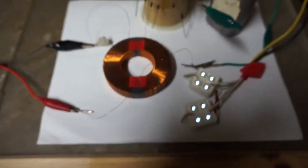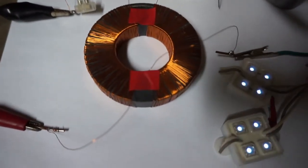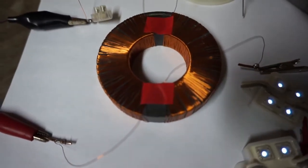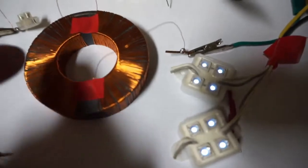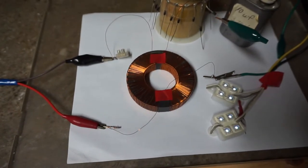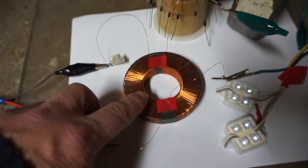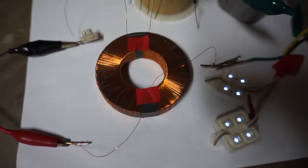What I'm thinking is that the wire — it's like 24-gauge wire on that coil — is way too thin, and it's wound directly onto the ceramic or magnet surface. I think the magnet is actually hindering this small amount of copper from being able to respond to the pulses and convey signal from one coil to the other. In the next video I'm going to take this winding off and put on 18-gauge wire with a little bit of tape to keep the wire off the surface of the magnet.